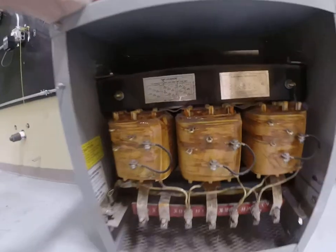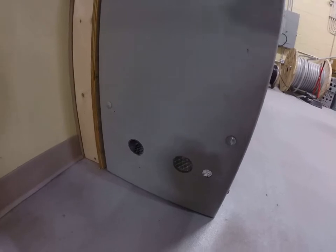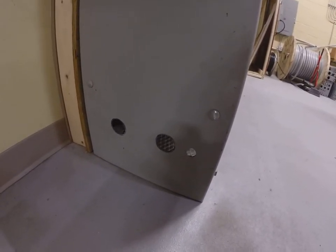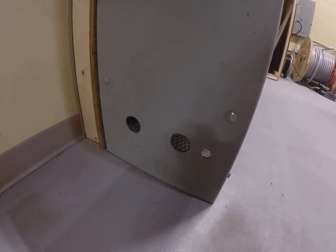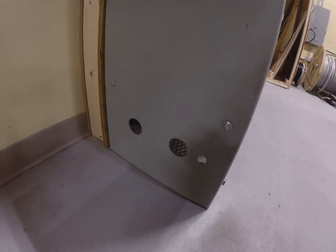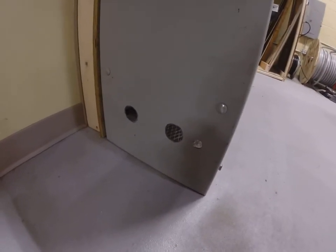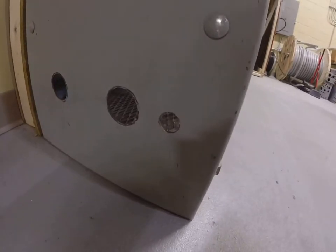And if we take a step back, if you look at the side, typically what we'd end up doing in the field is we'd come into the side of this transformer, maybe with the primary in this case, and you'd have a flexible connection. Usually we'd have a green field, is what we call it in the trade. The National Electrical Code Book calls it flexible metal conduit. And we would use that flexible connection because this is kind of a vibrating unit. It moves slightly and it's easier to work the wires in. We would come down the wall with EMT and change over to greenfield and then flex into the side of that. Manufacturer would suggest where you would drill those holes to come in with the primary.